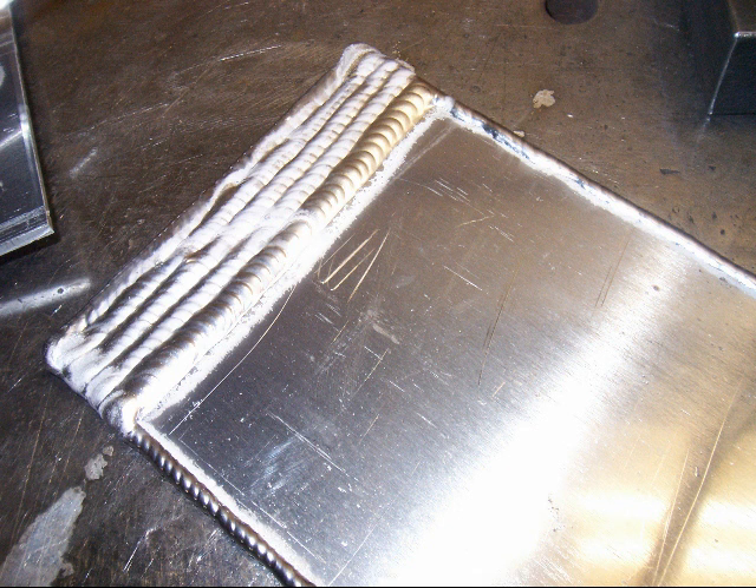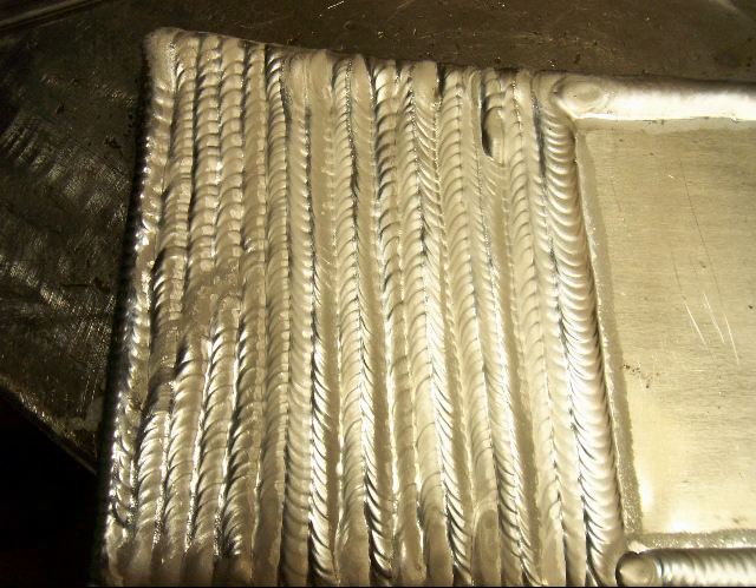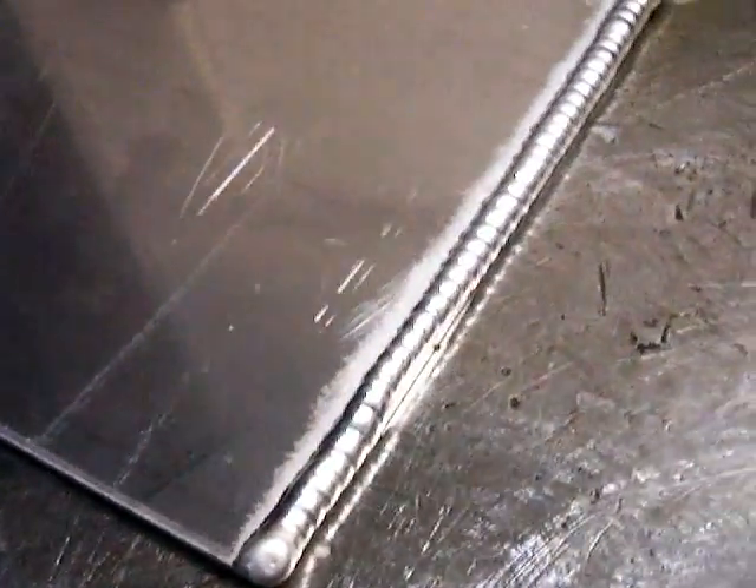Because you can get seat time with a little bit of money. One piece of four by eight inch, roughly 11 gauge aluminum — it can be 3003, 6061 — it doesn't matter the kind. You can get lots of seat time just by stacking beads. With steel it grays up and oxidizes and doesn't weld the same after two or three beads.